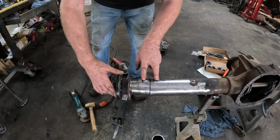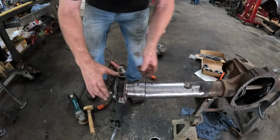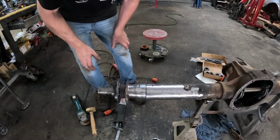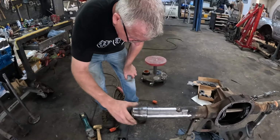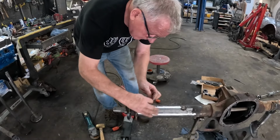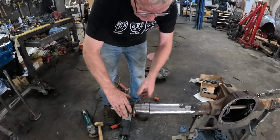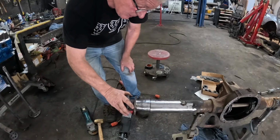We've got 2 3/16, so we've got to bevel this cut back anyway. You can see there's a couple of little gaps there where the Sawzall's not the most accurate thing to be cutting it with, but that's not a bad line. It did its job. So we'll do some bit of beveling, we'll get that gap down. That straight line we drew through here gives us our clocking. We know we're clocked in the same place we used to be.